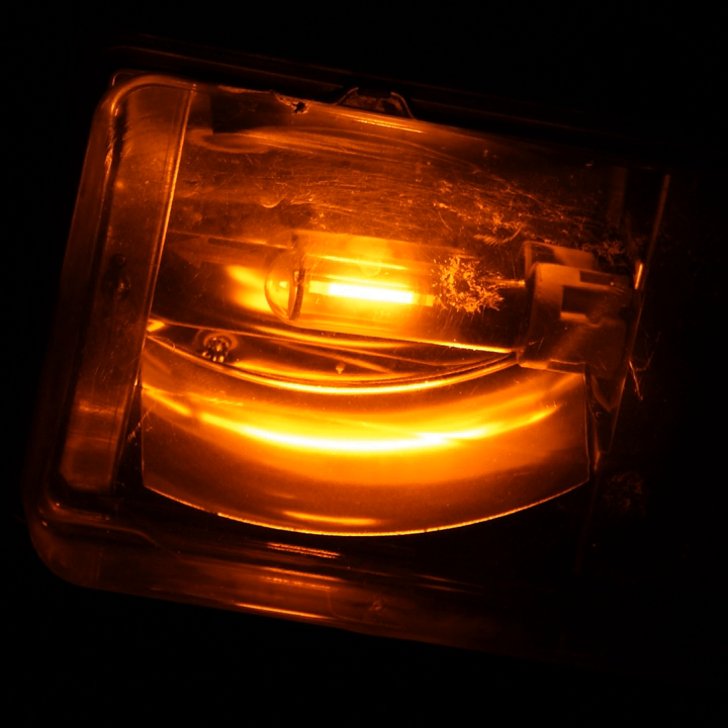A laboratory demonstration of a high-pressure lamp was carried out in 1959. The development by General Electric of a sintered aluminum oxide material with magnesium oxide added to improve light transmission was an important step. The material was available in the form of tubing by 1962, but additional techniques were required to seal the tubes and add the necessary electrodes, as the material could not be fused like quartz. The end caps of the arc tube would get as hot as 800 degrees Celsius in operation, then cool to room temperature when the lamp was turned off, so the electrode terminations and arc tube seal had to tolerate repeated temperature cycles.